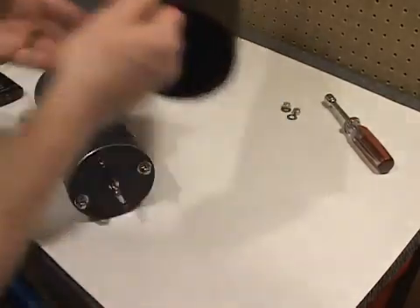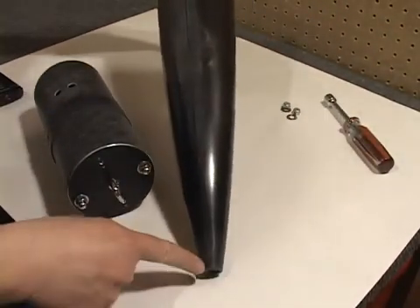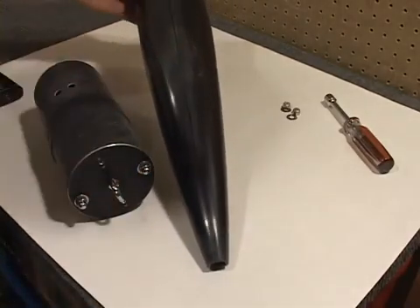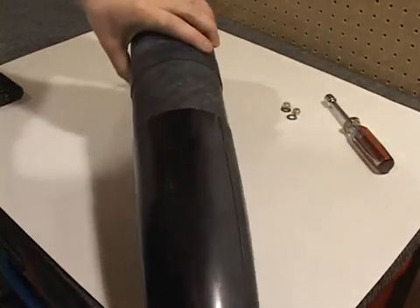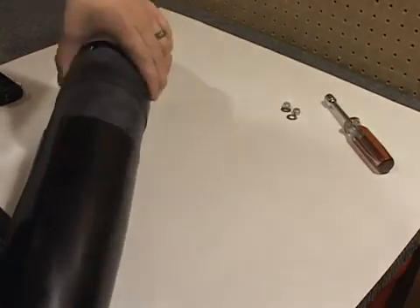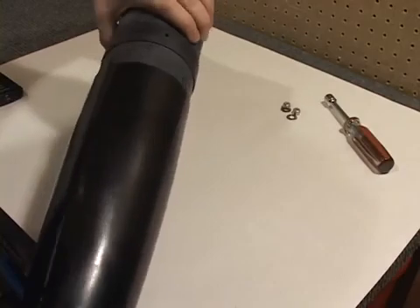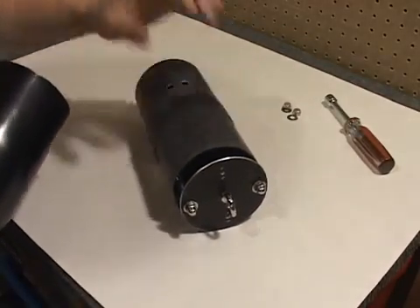Additionally with the nose cone, you're going to want to drill a vent hole ten inches down from the tip in order to vent the cone. The fit of the cone onto the coupler tube should be snug — not overly tight, not overly loose, relatively snug. If it's not, I would suggest sanding down the exterior of the coupler a little bit more.